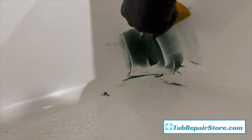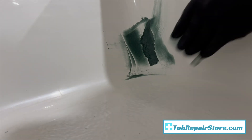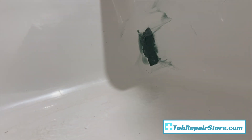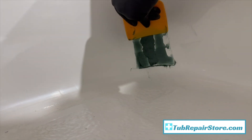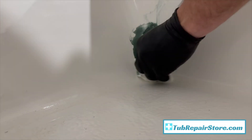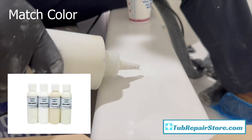I compare the ratio to about the size of a baseball to a size of a marble - it's not an exact science. In your kits you will have a tube of hardener that will be enough to harden both your glass putty and your finish putty. After you stir it in, make sure to mix it up really well - you don't want any blue streaks. You want it to be one consistent color. Fold it over like we do in the video, and then you have roughly about three minutes to work with the product before it starts to harden. If it does start to harden, just stop - it'll start to clump up on you, so don't keep going.